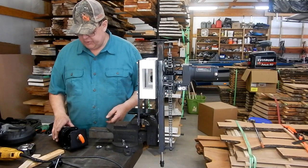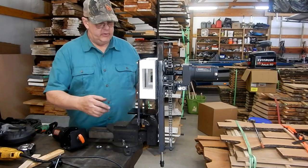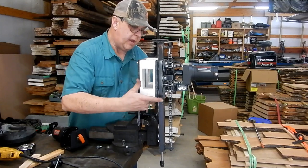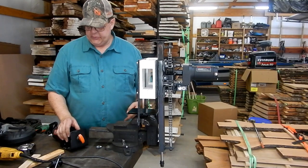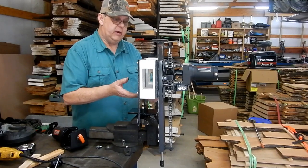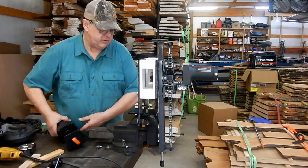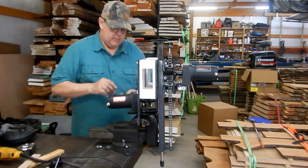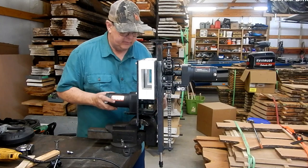I just need to put the drive winch in. Same sprocket on this one as on the other. The chain stretches from rail to rail on the sawmill and runs right up against the bottom of these guide blocks. This sprocket actually runs a little bit high to these blocks, just a little bit, to make sure that chain stays engaged. I drilled these holes out a little bit to make alignment just a little bit better.